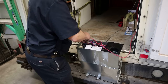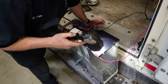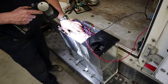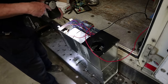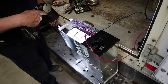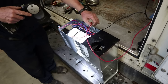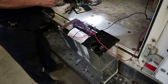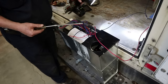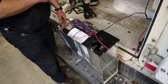Let's see if we can figure out which one it is. I'll get this board out of the way for now. Our high-limit switch is not over here behind the gas valve. Our sail switch is inside on the back side of this plastic cover. Let me get this cover off — it's just got four quarter-inch screws in it, way down in there, so we'll use an extension on our driver. The high-limit switch is down in here, but we need to get to the sail switch anyway.